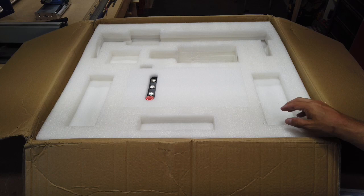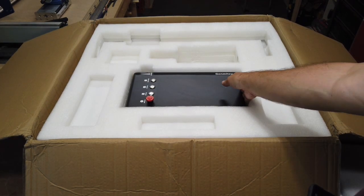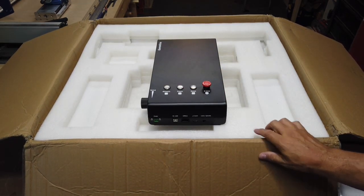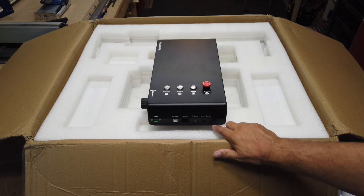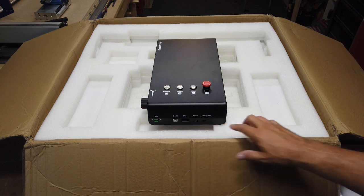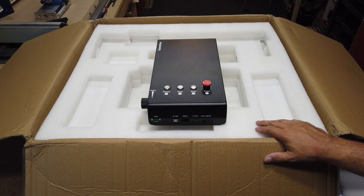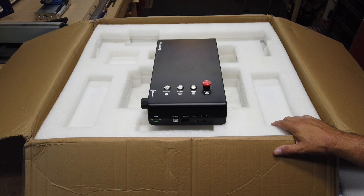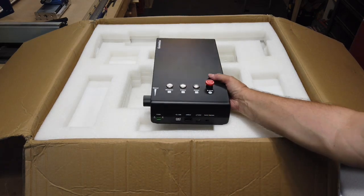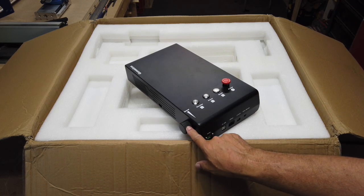Okay, so I got that stuff out of the way. What I did forget here is you got the new updated and upgraded control box. You have your front connections here and your laser and spindle switch connection for the laser, offline controller, the USB, and the Z probe. And then pretty typical again for the original version of the 4030, your emergency stop, reset, pause, and resume button.